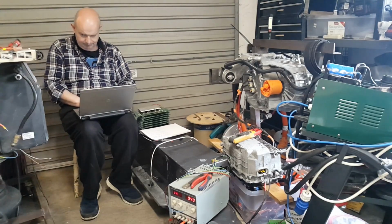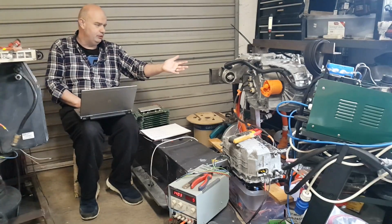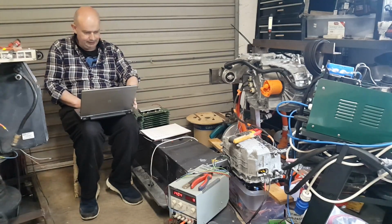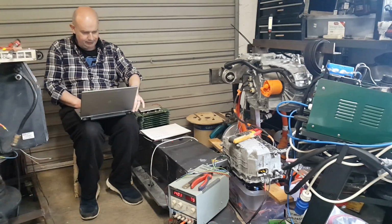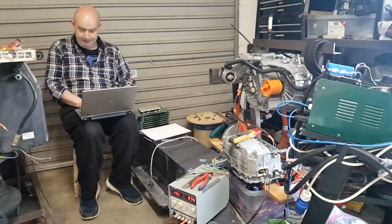So our pin swap is in here, so everything should be good to go. Okay, we have FOC firmware back in. Now we start in manual mode here, we're on resolver. So I've got pole pairs 3 for the motor, no idea whether that's correct or not. Resolver pole pairs 3 also. Again, no idea whether that's correct or not.